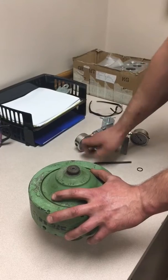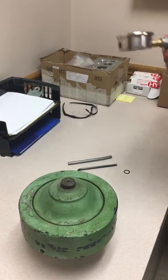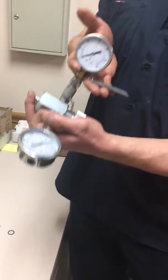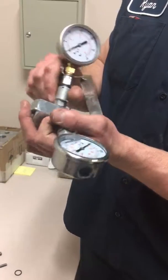You should hear no nitrogen coming out of the accumulator. Step two: you must take off the tank line gauge, because it will ruin the gauge — it will spike the pressure and it will be no good.